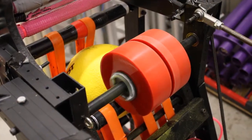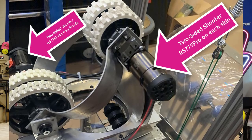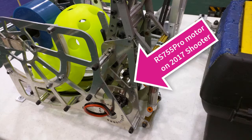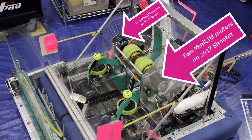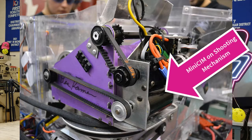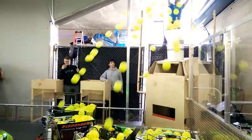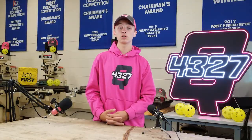Another common mechanism in a challenge is a shooting wheel. Whether one-sided or two-sided, the mechanism needs a high-speed wheel that can spin up quickly. We might look at the RS-775 Pro motors since the load from launching the game piece will take place quickly so as to not stall the motors. Connecting a pair of these motors with a small 3:1 gear-down ratio could be your solution. Alternatively, the Mini CIM with a 1:1 gear ratio could achieve a similar speed. Using a full CIM may cause heating issues over the course of a match and the weight may be prohibitive. Using a Bag motor would lack the power needed — motors would slow down too much between shots. This relates to spin-up time: the period needed to get the shooting wheel up to speed either from rest or between shots. This is why we look to use a more powerful motor even if the Bag motor could offer the same overall rotation speed.